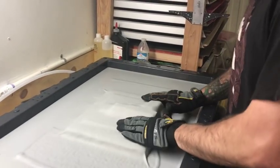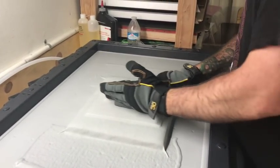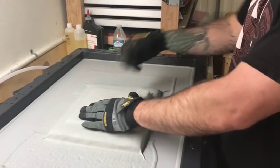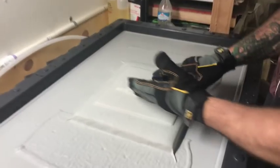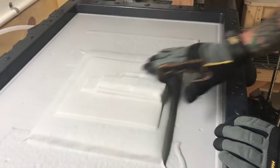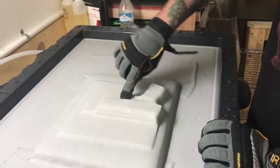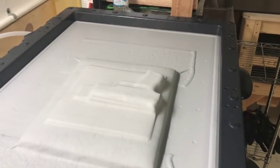Hit the vacuum and then work it — you just work it. That's a good pull: about 20 inches of mercury. Right now this is the part where you get good definition — you do a little bit of a massage. The vacuum's pulling, getting down to around 20 inches mercury. See how you get the definition of the gun in the plastic? If there was bad definition it would just be really dull. You want the indentation of the trigger guard — you can almost pick up the serrations. The carbon fiber is coming through, so that all means we did a good job getting vacuum.